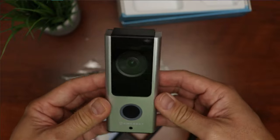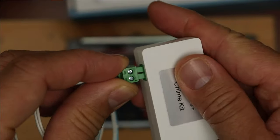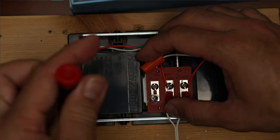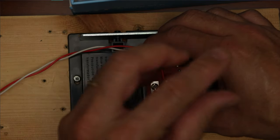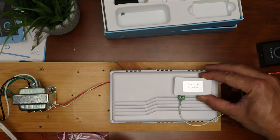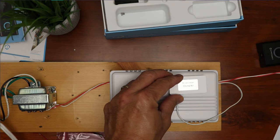Time to install the chime kit. Connect the wire harness to the chime kit, then loosen the front screw and connect one of the wires. Connect the other wire to the transformer screw. The chime kit is too big to be installed inside the chime, so you will need to stick it outside using the included mounting tape.